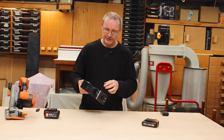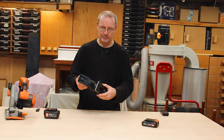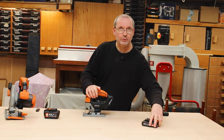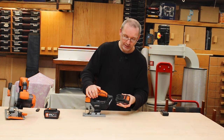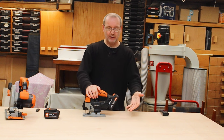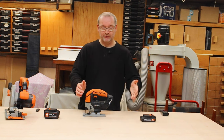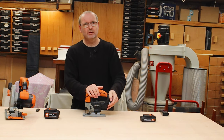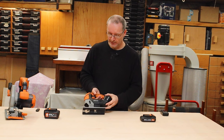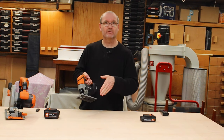There's a lever at the back so you can change the angle of the base plate, and it just locks back into position. The only minor thing I found on a quick look is that the battery is a bit hard to get in, but apart from that it's insignificant — it locks in really nicely and tight, which is good especially when you're going round corners. It has four positions for your pendulum action.